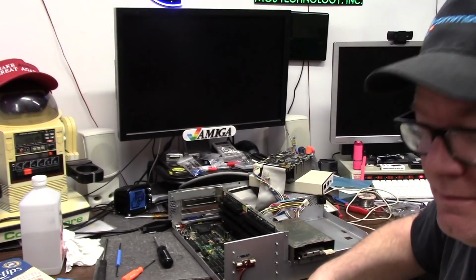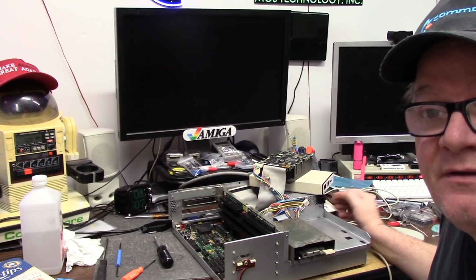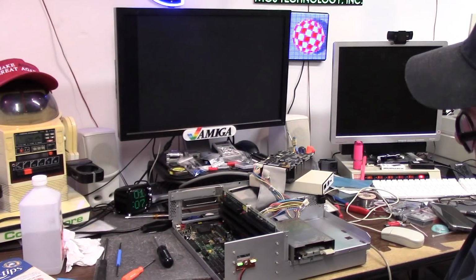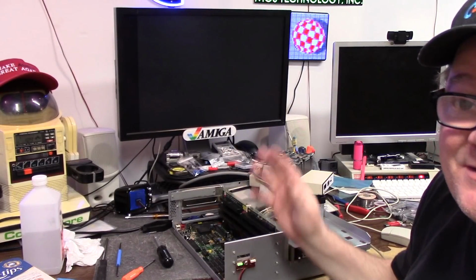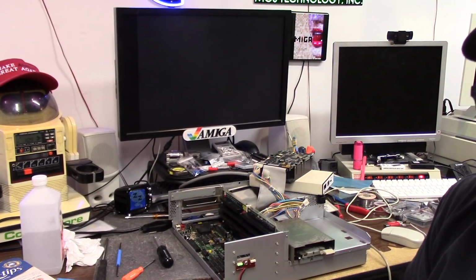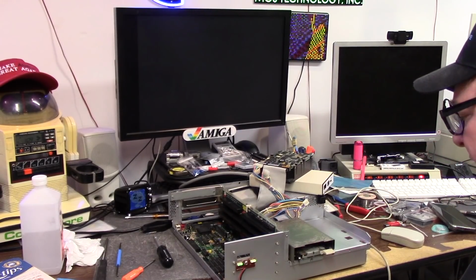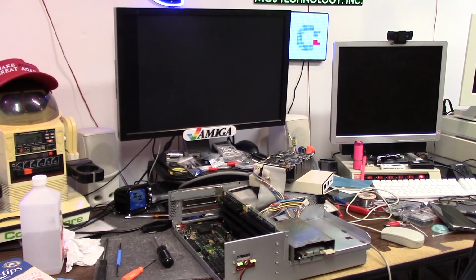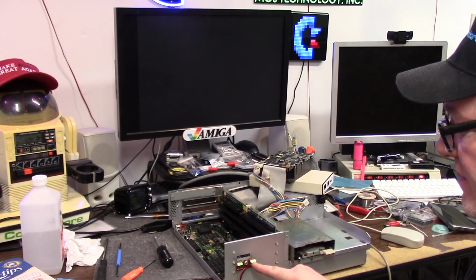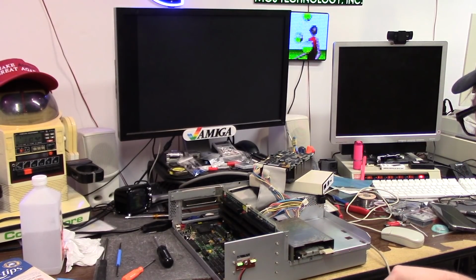I forgot to record. I was playing music mods. I don't have the lid on yet. I hooked up a SCSI hard drive. You can see the light will work. It should boot my Workbench 3.1. This is a 3.2 ROM. I've pre-copied the libs for the 3.2 or 3.14 and greater to all my drives in the past. Sorry, a little tired. Hard drive light's functional. Floppy needs to be wiped off and screwed in. I have to go get longer screws.